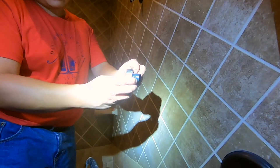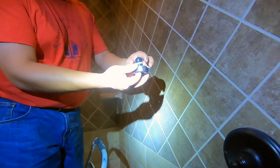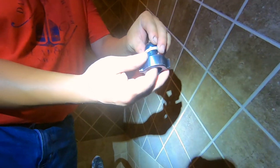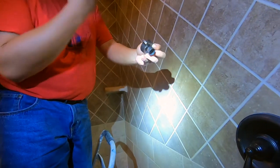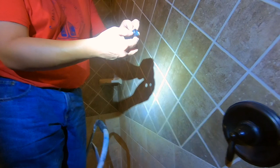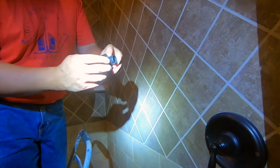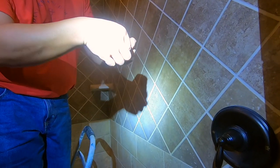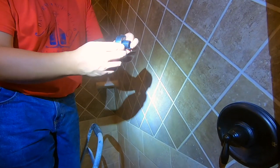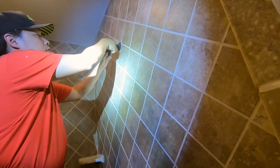I'm going to attach what they call the ball set first. There's the ball part, then a nylon part that stops it underneath, and then the whole thing goes into a kind of wing nut set. This part screws in there, and then later screws into the shower head. There's a flat side here, so I'm going to hand tighten it and then do about a half turn using a pipe wrench to tighten it a little further. Just put it there, make sure to seat it well, and start turning clockwise.